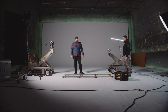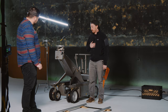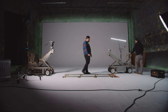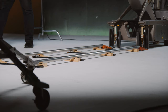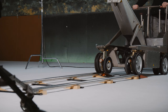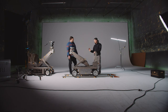Right now we have circle track, and there are two ways to put the dolly on the track. The first way I'm going to show you is with the track wheels, which I've already put on the dolly — they have a groove cut out in them so the dolly just pushes right up on the track and stays there. You get these starter wedges, put them in, and align the dolly up. You crab over, get it lined up with the outside of the circle track wheels, and you want it to be in rear mode when you go up on the track. Then just push up onto the track — and voilà. With the track wheels on, you can utilize the brake and walk away.